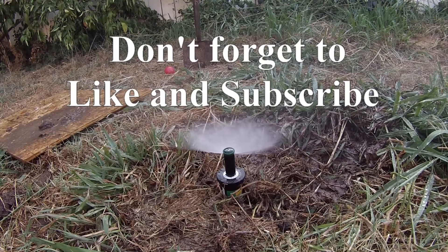The top of the riser is going to screw onto your sprinkler head, and the bottom screws down into the T. At this point you want to tighten it down as tight as you can get it. If it's still too high, you can go ahead and cut one more section off the riser. Looking at it, it might be a smidge high — we're gonna go ahead and cut one more riser section off. Just unscrew it and cut that riser section off, then screw the sprinkler head right back down into place.